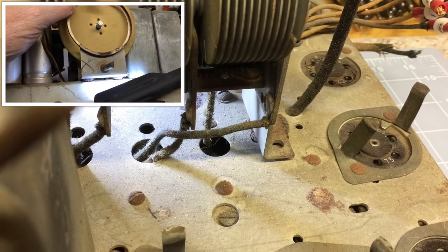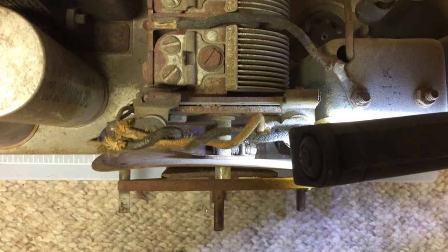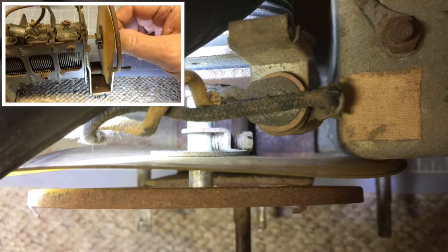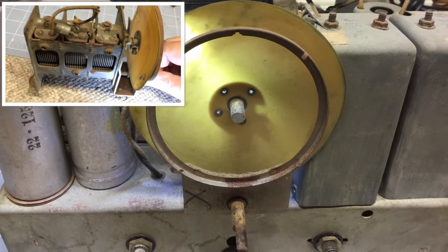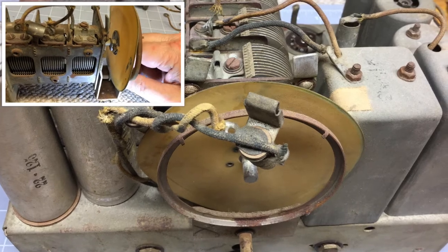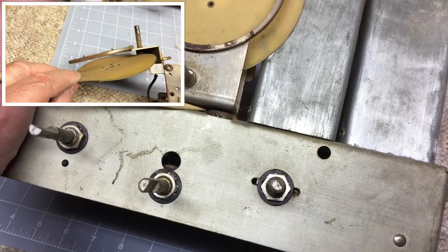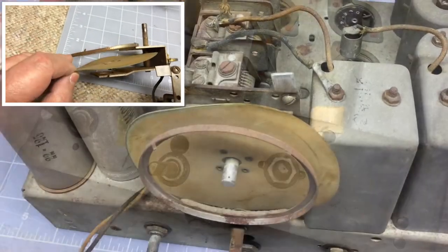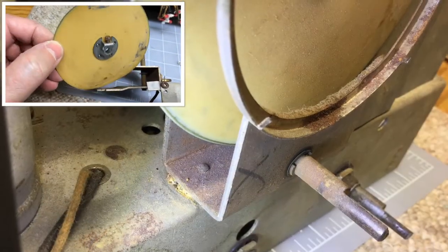Aside from the electrical challenges on these radios, I love the mechanical aspects. You can see here that the tuning is actually accomplished by rotating a four-inch diameter piece of plastic that attaches itself to a lower shaft. Now this piece is really really warped — I've got some picture-in-picture video showing how it actually works. So I'm going to try to clean that up, see if I can apply some heat to get it back in shape. If not, I'll actually just reproduce that particular piece.